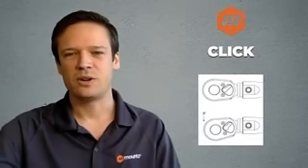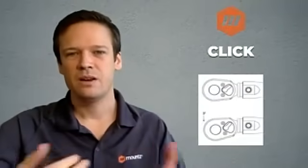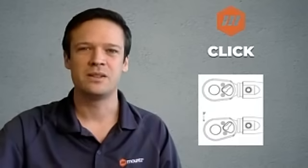Looking at a click wrench, you have here a drawing of the head of a click wrench. What happens when the torque is reached? The tool will click, you will hear it and feel it, and then there is a 3 degrees free movement that the head can move. After these 3 degrees of free movement, the mechanism inside the tool will basically lock, making this tool a straight bar.